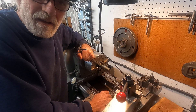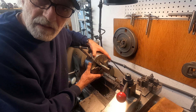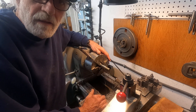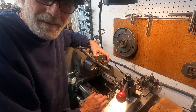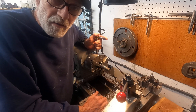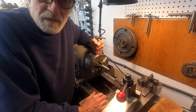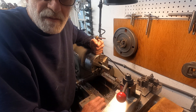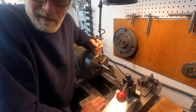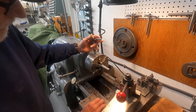Because of the clearances and thinness of the body, scroll chucks distort, so a scroll chuck is not your best option for the highest precision work — especially at high speeds. The old four-jaw is your friend, really, that's how I look at it. There are other chucking options too: you can make a shrink chuck, which is just a hole in a piece of metal you heat up and press your work into — that doesn't leave any stress risers. Collets and other options exist as well, and nothing is perfect.